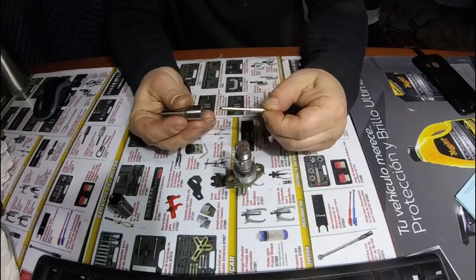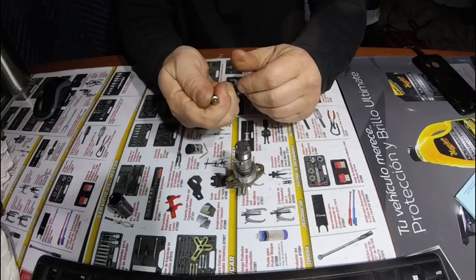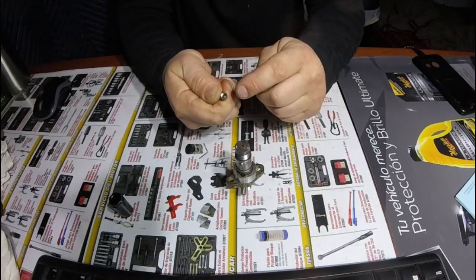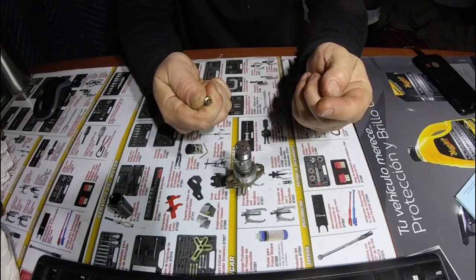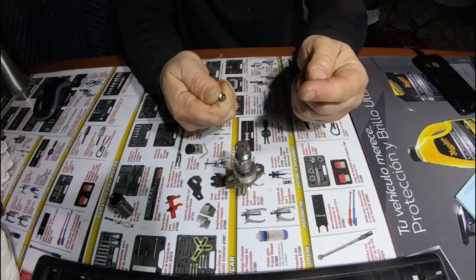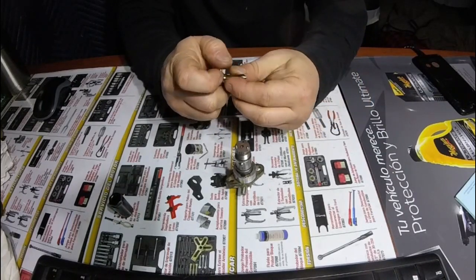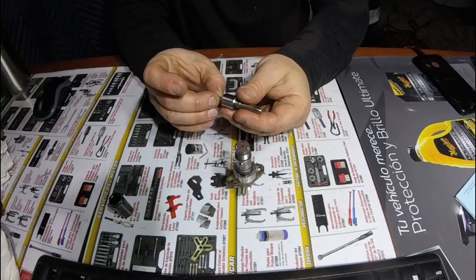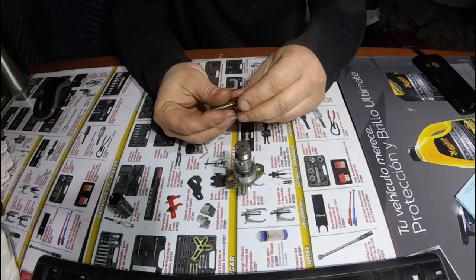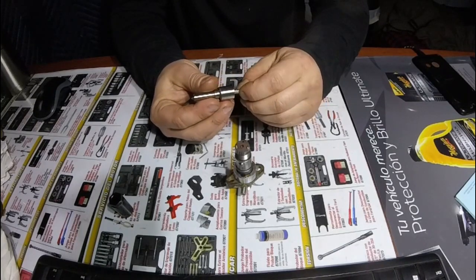This is actually kind of where the working end of it is. This is actually exposed to the combustion chamber, so it gets a lot of heat. The original reason I pulled this injector was to get a sample of the carbon deposits inside the chamber — there was plenty. Obviously not enough to be very detrimental to engine operation, because that wasn't the problem with it, but I still wanted to get in there and clean it.